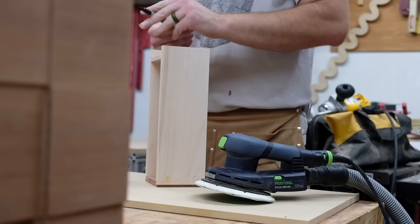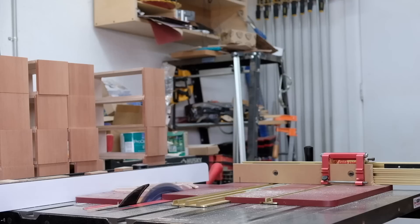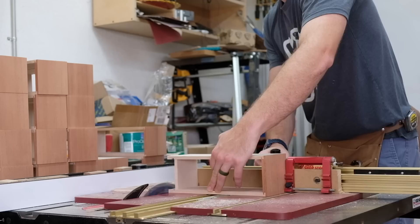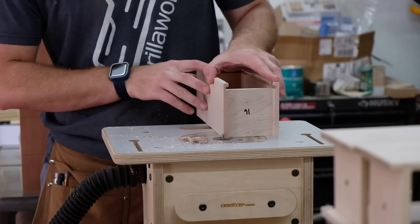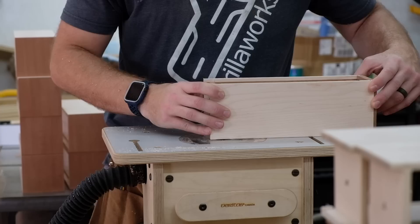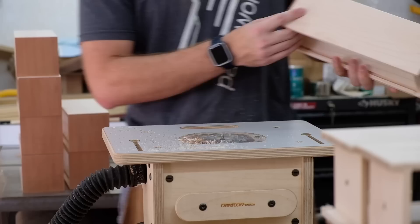Up until now the drawers are just labeled with pencil on the front. Before sanding I permanently label the back piece, which was sanded before the glue-up. I also intentionally leave the drawers a bit long — this gives me enough material to cut away so that the drawers sit flush with the cabinet front as they butt up against the cabinet back, sort of like a built-in drawer stop. Adding round overs to every edge of the drawers was another tedious task but provides a huge transformation to the overall look. The first few took me about 55 seconds each but by the end I was closer to 45 seconds, and like most tasks I did these in batches of 8 to 10.